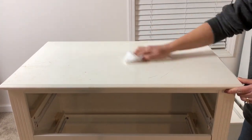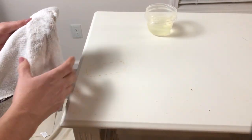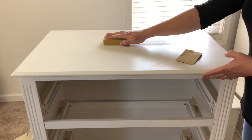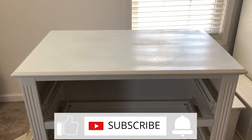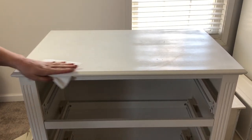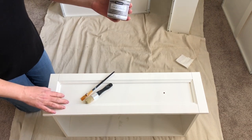It looks so beautiful with these feet on the bottom. Now it is time to really work on the top and get it cleaned. I was able to remove most of those stubborn stains on the top using that bleach mixture, but there are some dents and cracks and I'm going to be painting this. So I am taking some 150 grit sandpaper going over those dings and scratches to make sure they're nice and smooth, then I'm going to take my 220 grit sanding block and go over the entire top part of the dresser. Since I will be painting this and it has such a smooth finish, I want to make sure that my paint has something to really adhere to. Then I'll wipe everything off and remove all of that sanding dust and do the same thing to the recessed parts of the drawers.